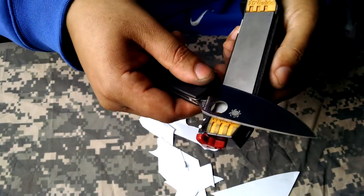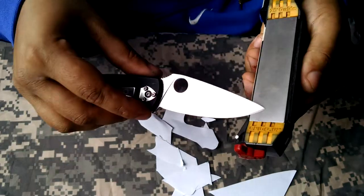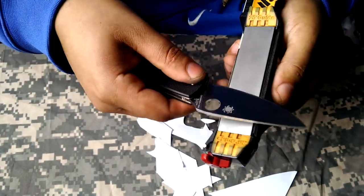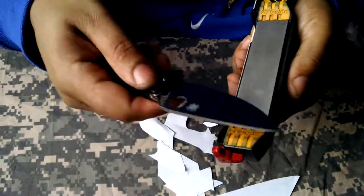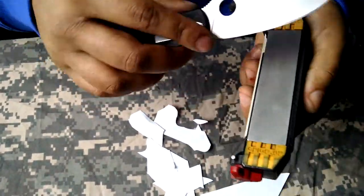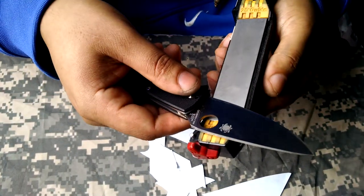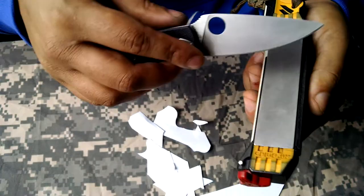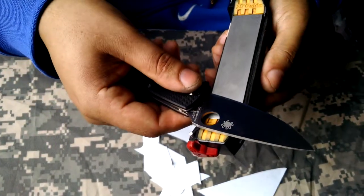When it comes to restoring an edge, you can definitely put some more pressure on there to really knock the little folds and things like that back in line. But we know that we have a good apex, and for whatever reason that light pressure seems to only get the little straggling pieces without deforming the apex that you formed.